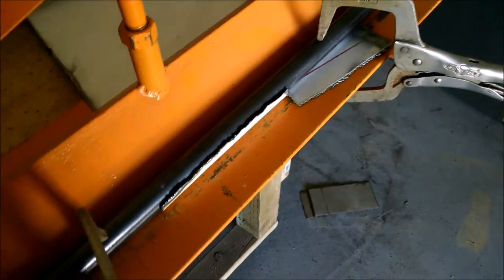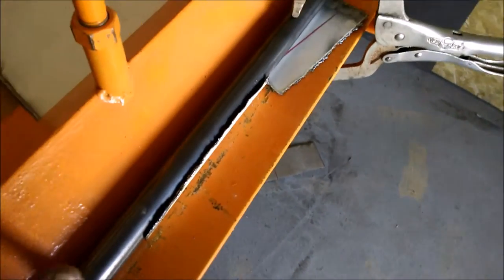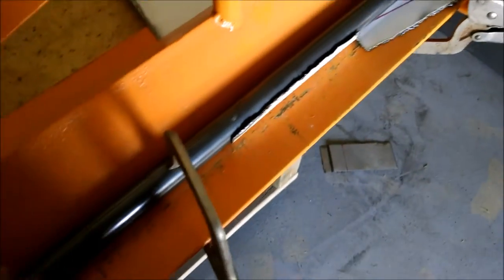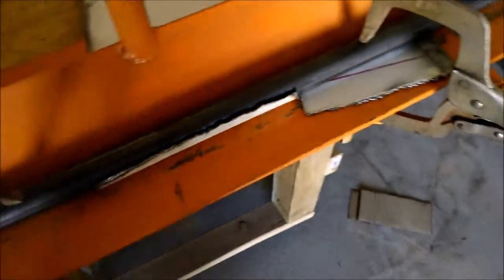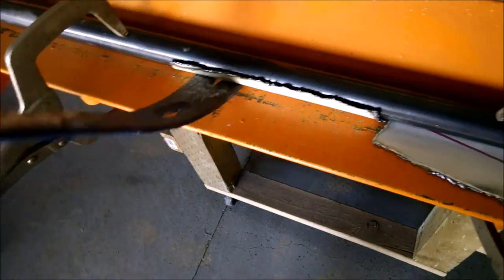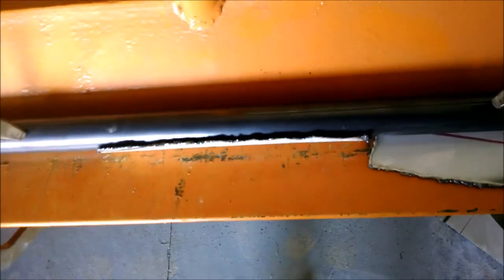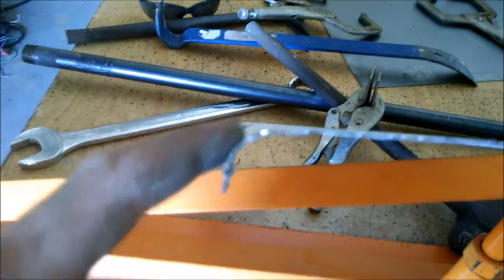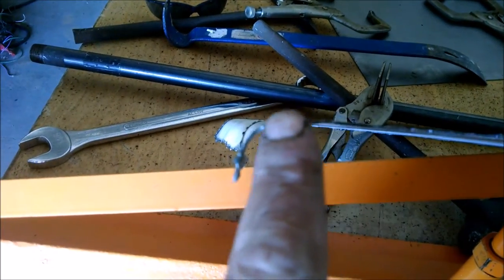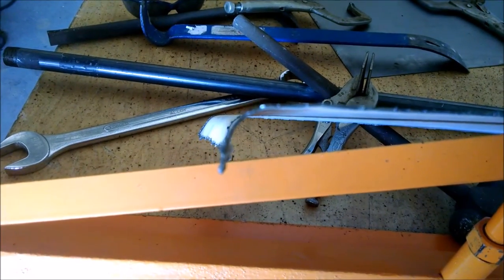Sometimes you need a rounded edge. I just have a 1-inch pipe. I clamp my piece of metal down in with the bender first, just took some C-clamp vice grips, clamped the pipe down, take this Wonder bar, flip it into there and bend it up a little bit, and take the hammer and finish it off, make it round. I'll show it to you when I get it all done. It's more of a bullnosed round edge to contour what I'm trying to mimic for my floorboard.